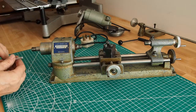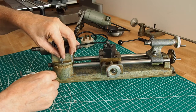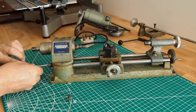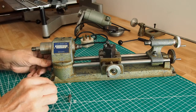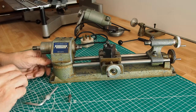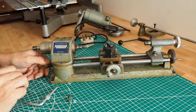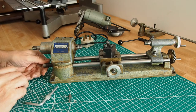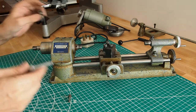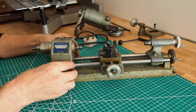Now if we take the headstock off - there's a small pin here, which I showed when I did the taper turning video. Then there's a bolt at the back here, so we undo that. If you remember, that was how we did the taper turn - we set it up to cut tapers. We can take that right out. It's quite a hefty bolt but again still with the five mil allen key. And there's the tapered pin, so now our headstock can just lift off.